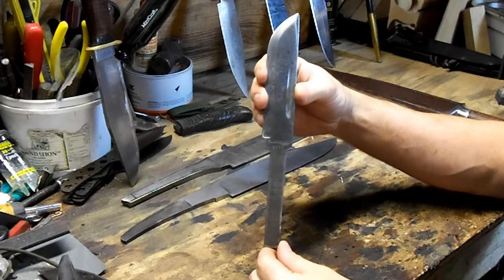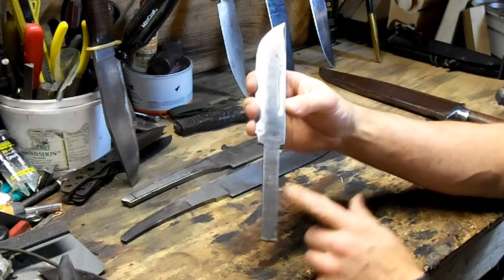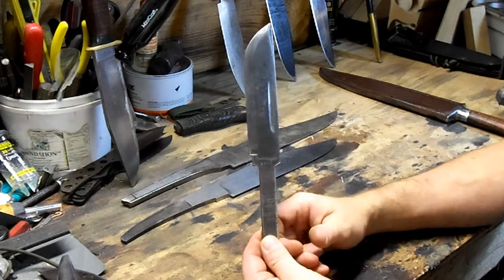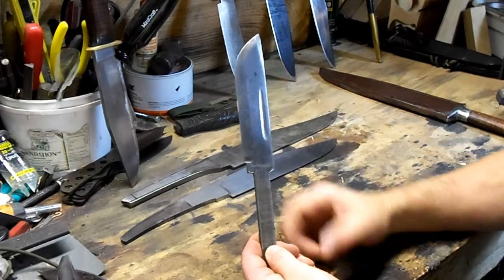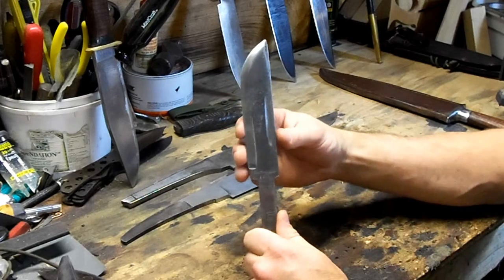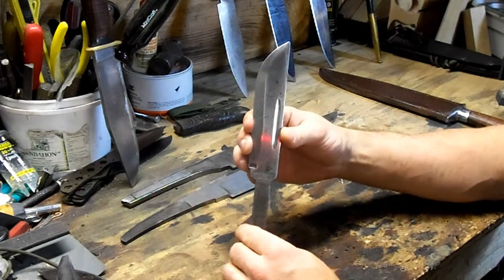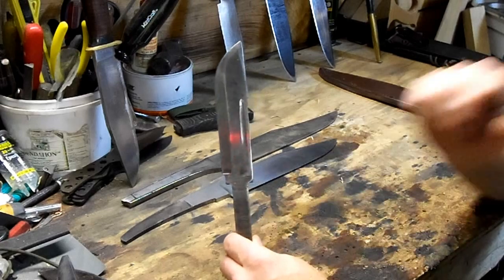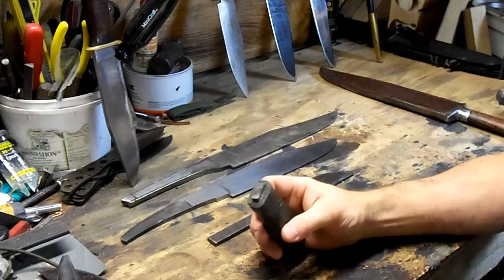This is a lot more rugged than the rat tail tang. This is a decent-width tang — probably 50% or a little bit more of the blade width — but it also has a fairly abrupt tang transition. If they brought that out with a little bit more of a radius, a little more steel in that area, this would be a lot more rugged. Another thing that hurts this knife is that it's through hardened, nearly as hard as the blade through the tang transition. That exacerbates the problem of having that abrupt angle. Had this been a better tang transition, the heat treatment wouldn't really bother it that much. It's not ideal, but for a production knife it's pretty good. These knives will take some use and some abuse — the problem is, someday if you're really using it, this will happen to you.